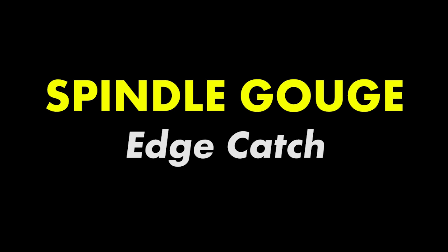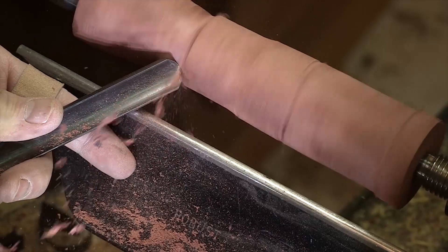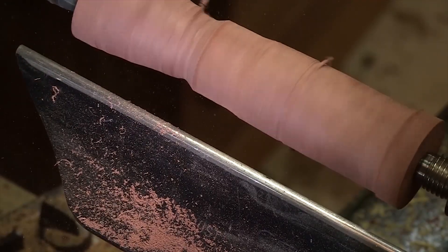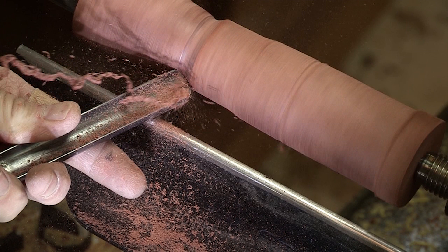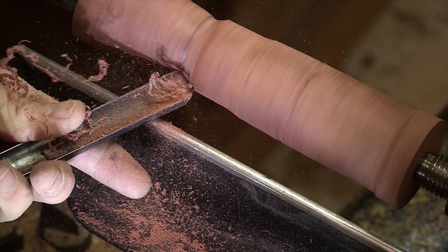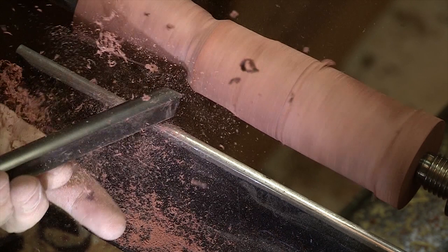And here it comes. Catches are not often spectacular — they're just design modifications, which are really frustrating. You can see I'm starting to put the balance onto the edge — boom — and it catches. I went from the leading edge up to the unsupported edge, so there's nothing supporting the tool at this point on the tool rest. Physics tries to fix itself and rolls the tool to where it will be supported. At that point, though, you've lost control and bang — you get a catch.